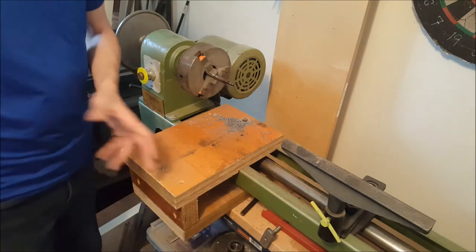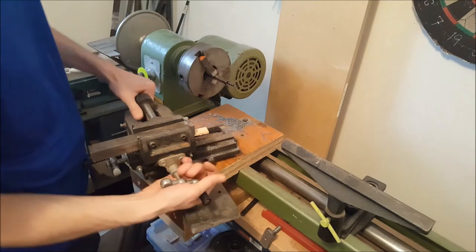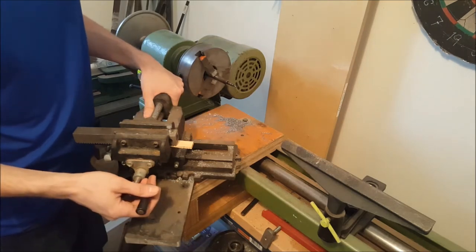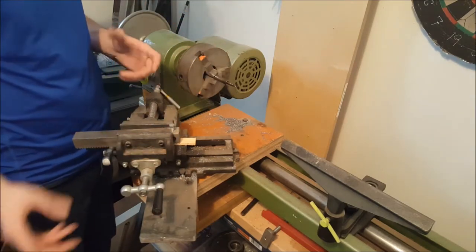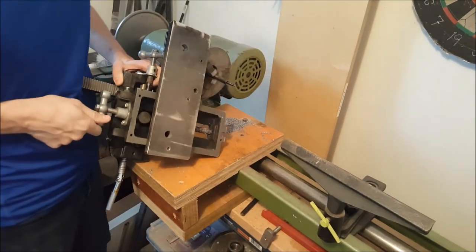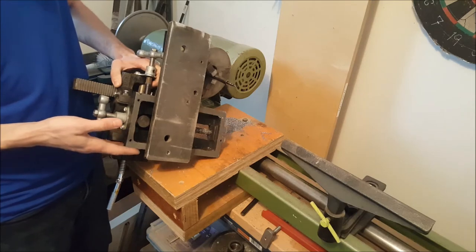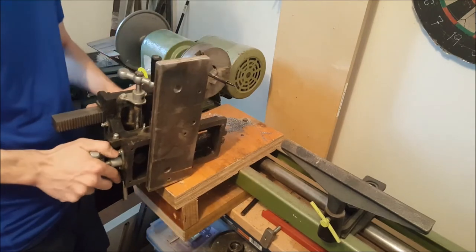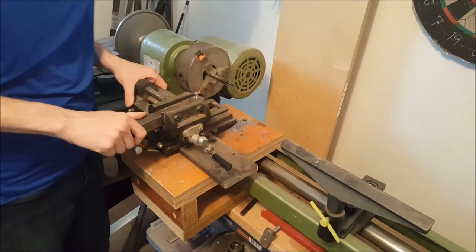I'll show you a few pictures of how I put this together. The next step is mounting the milling vise. My milling vise has places you can screw stuff onto, but I was uncomfortable making a bunch of holes and just finding the right spot — I needed flexible angles to move it around. So what I did was take this half-inch steel plate, made the threaded rod holes right in it, and screwed my milling vise right on it. Then I've got two holes which I use to screw the piece right onto the table.